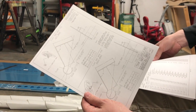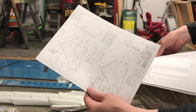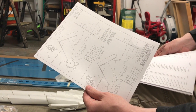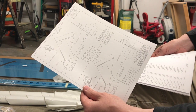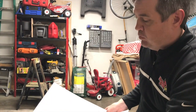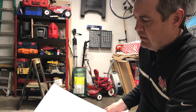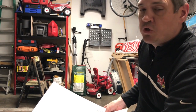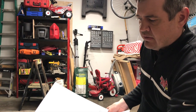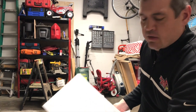Mechanical senders. We used capacitance style senders on our RV-7. But with all the movement and different fuel types and everything, I just figured we would go with the mechanical ones. It takes one less thing, the ongoing calibration or the future potential of mixing fuel types or having different specific gravity that influences the reading. Well, this is just a float, always works no matter what.